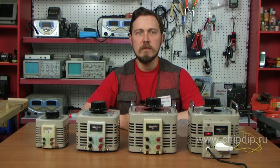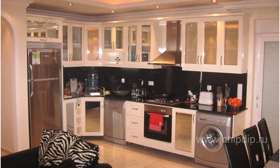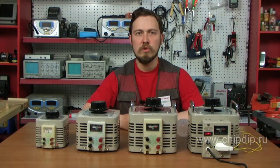Autotransformers are vulnerable to a short circuit. Customers should plug them into a network protected by fuses with a current equal to the nominal current of the transformer, or another type of protective device such as a circuit breaker. When operating, autotransformers must be grounded.